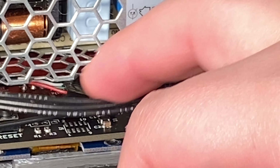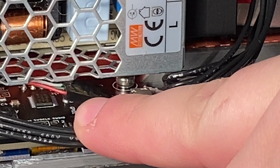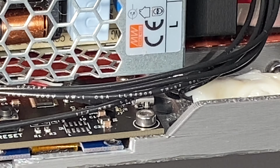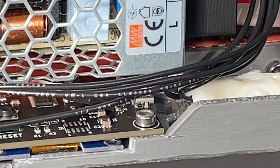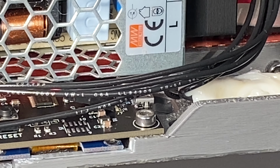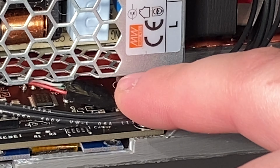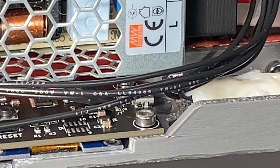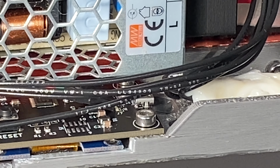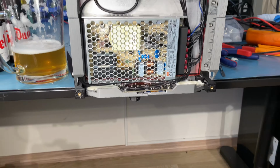So it's just connected here, the colored wires there, that's just a USB cable. Hopefully I got the colors right on these. USB color coding can be a bit messy, but if they followed the spec, it should be correct. But I've seen cables that don't follow that, like I've seen white and green swapped for some reason, for example, so you never know. It's just a USB cable I chopped up, and hopefully it will work. It's an LG branded one, so maybe it's higher quality, but who knows. So we will see. So this is the wiring on the backside for this.